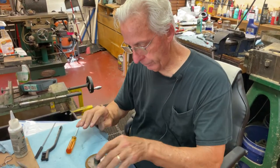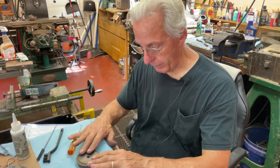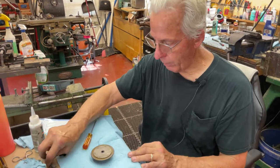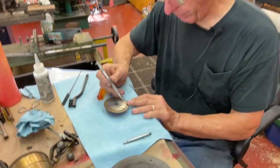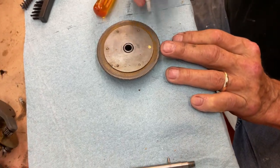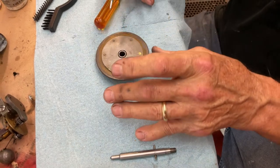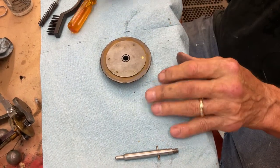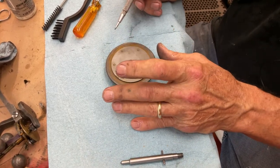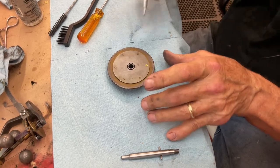So to take this apart we have to do a few things. This is the bottom, so when it assembles you'll never see this on the motor. I took my scratch awl and I made one little mark right there, and then I took some gold paint and painted the screw in gold. Because we're going to reassemble it in reverse, but you have to align one screw hole up to put everything back where it was. You have to put the gear back in the same position, and that's why we do this.